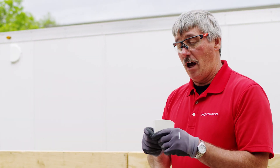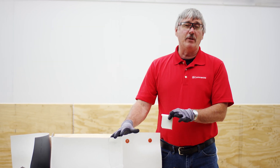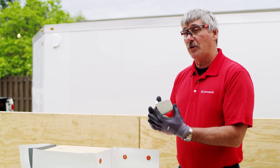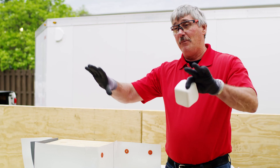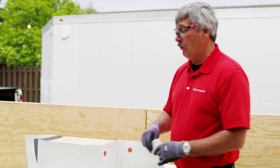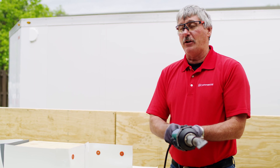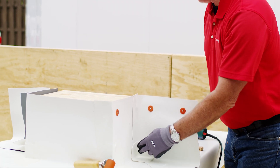These are a little challenging to weld because you have a small area. Doing an inside corner is a lot different than doing an outside corner — all that heat will get trapped, so you have to move pretty quick and turn your gun down. On an outside corner the heat can escape, but in here it's going to build up pretty quick. We're welding unreinforced membrane, so it's not going to take as much heat. The important areas to weld are these angle changes — these are typically where we're going to find all our voids, and these are the first areas I'm going to attack.